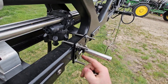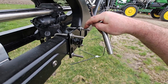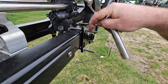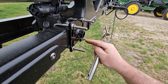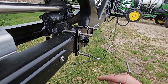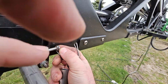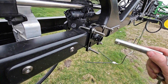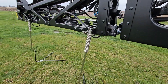These are removable pegs. Not that you're going to be wanting to smash your carbon fiber boom into tree limbs, but these should be cut off when they come from us. If they're not cut off, you'll have to quick-cut those off so that the drop works — you can see this one I cut off already because the spring hits. The intent is that we take that on and off: when you are not dropping nitrogen, this comes off; when you are dropping nitrogen, put that guy back on. The last two positions are identical to that.